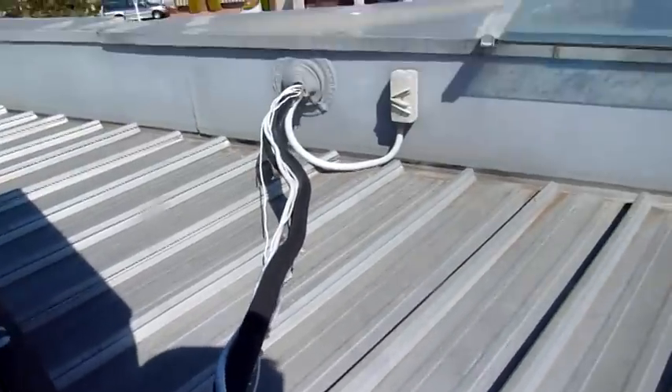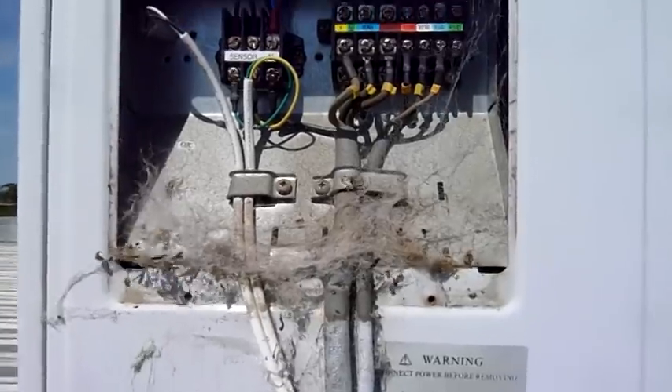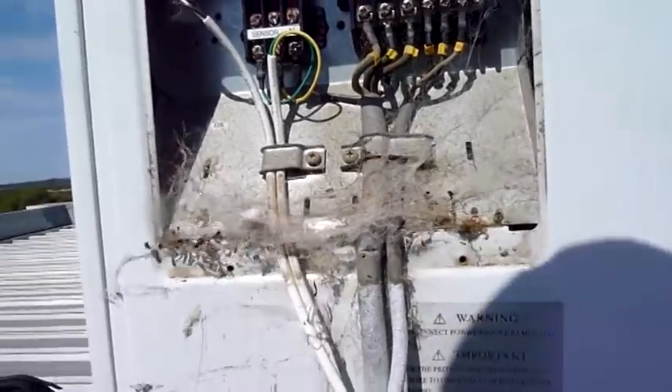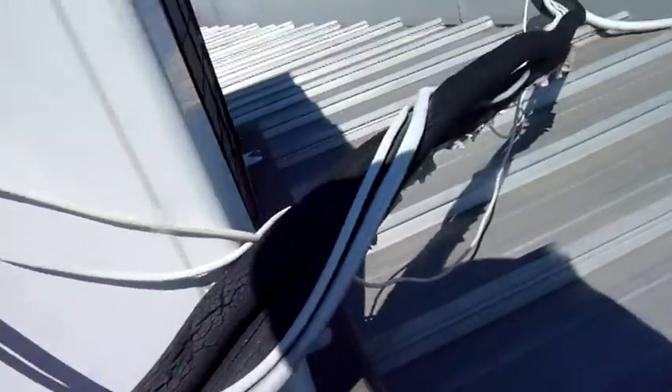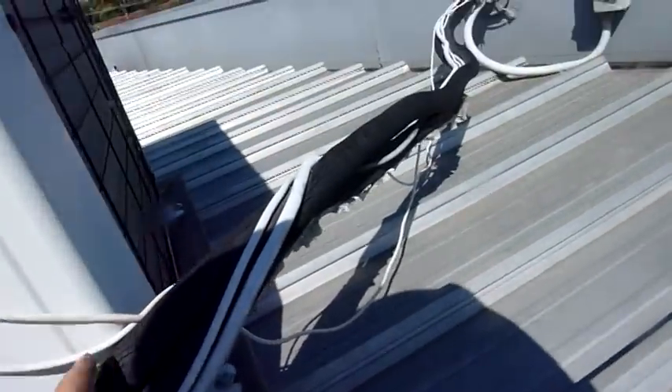Okay, back to it. This is the one — there's an isolator there, I'll check that one. Got my meter. Main breaker's off now, don't read any volts, whereas before when the breaker's on you do. These are always lying. Oh, that's degraded — that should have been put inside a line set. I don't know how they installed this but they did a bodge-up job of it.